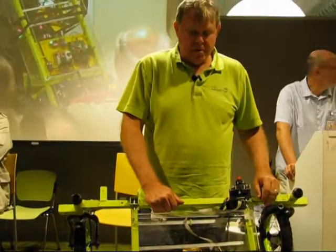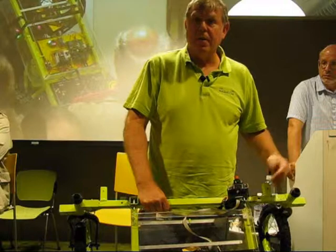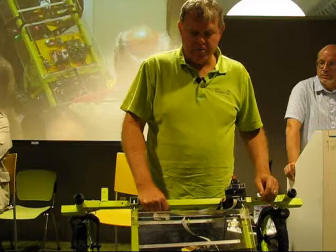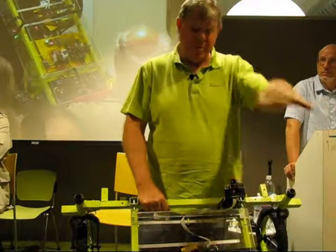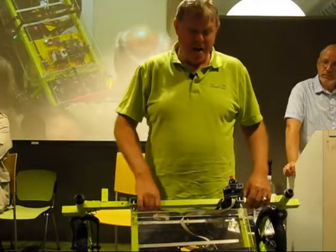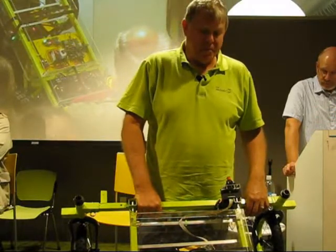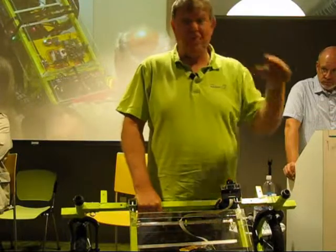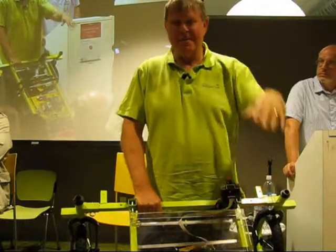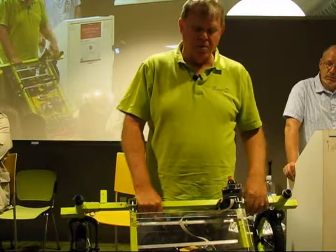Those are just extras. Basically, you need some sort of sensors to tell it where it is, and you've got the wheel odometry, which is enough. If you give it a plan, it can try to follow the plan. But when we had it in a competition, it had a lot more stuff on it. We had a big signaling system because you have to have lights on it, and we had a gantry with a claw that would pick things up. We had the RDF, which had a metal plate that was a pan for a hot water heater up at the top with little radio antennas on it, a whole bunch of other stuff. But this is really the core of what you need.